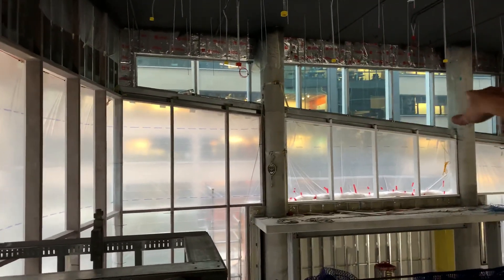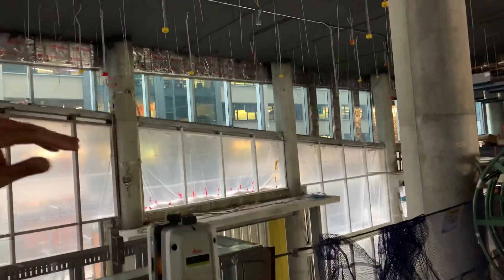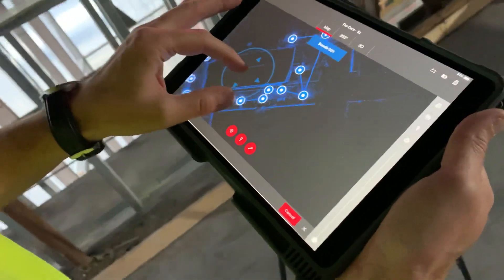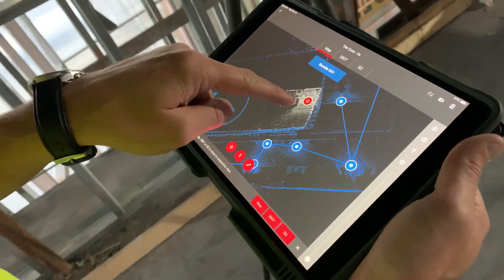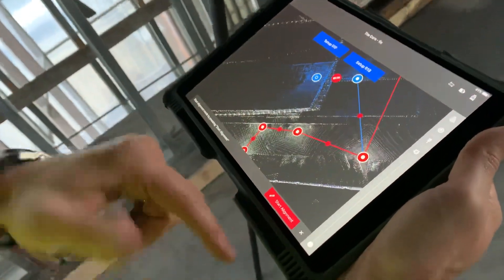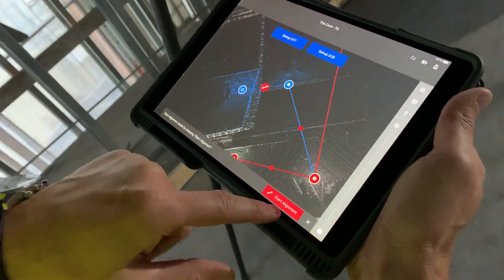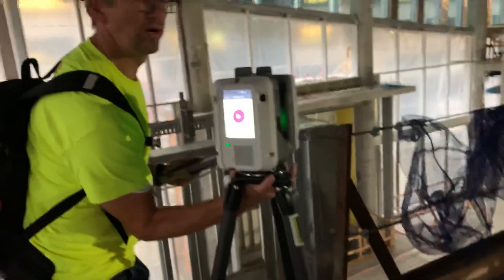For this right here we're looking at the edge of tube steel, and we've got windows and reflectivity all around us, so we just want to be aware of what we're shooting. You're seeing that high reflectivity out there, but the results we're getting are very clean — you can look at the edges, they're really clean. I'm really liking that. Let's see if the viz takes us into this secondary spot — look at that, there we go. I dropped this right in. I'm going to link — select that one, select that one — you can see the alignment looks really good. The edges don't have overlapping data, so I'm going to say start alignment and create link. I'll just hold that link because I know we don't have overlapping data.